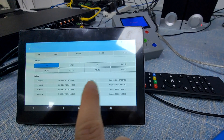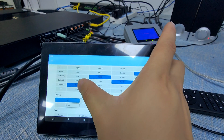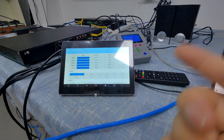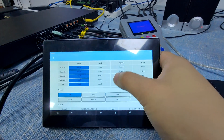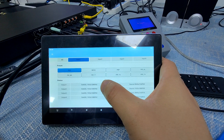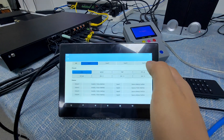But the input is actually using 4K60Hz. So input 1 is switched to output 1. We have all sources showing the same input 1, switched to all the outputs. But for the outputs, we have the 4K60 input, and the output automatically scales down to 1080p 60Hz.